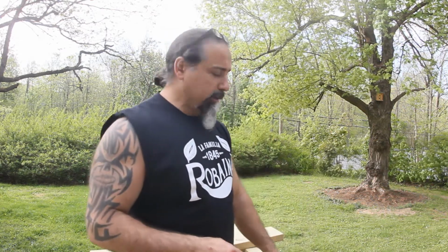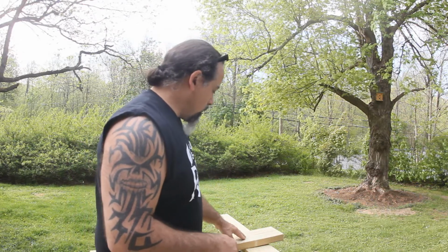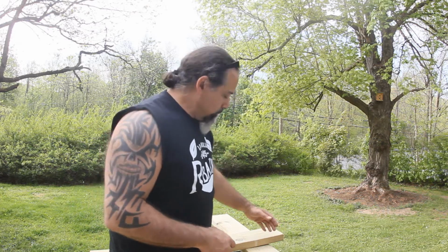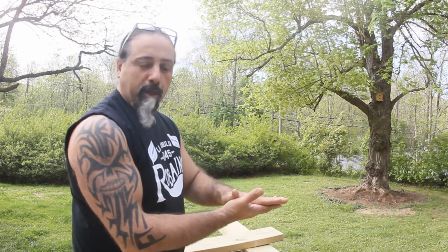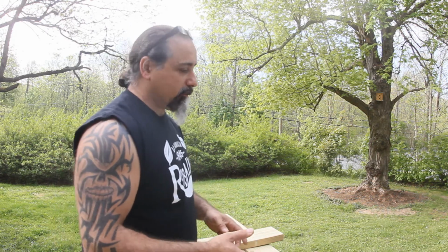So the next step here is I'm going to work on doing a top rail. I wanted to do something a little different. I saw another YouTuber, I think it was Ninja Carpenter, I believe. He did a really cool thing. Instead of miter cutting the corners to meet, he did a lap joint. And he extended the lap joint, so he cut the lap joint out with the top rail, met together, and then he extended it another inch past it. Very cool looking, very different.